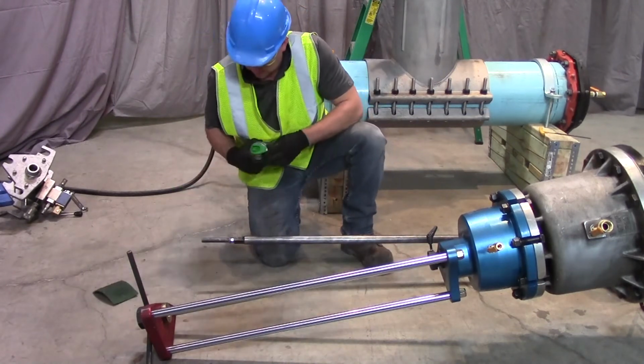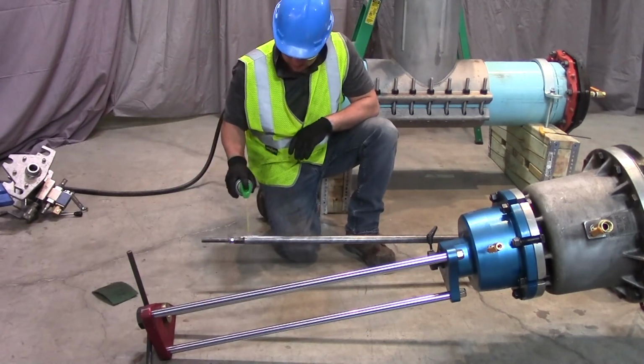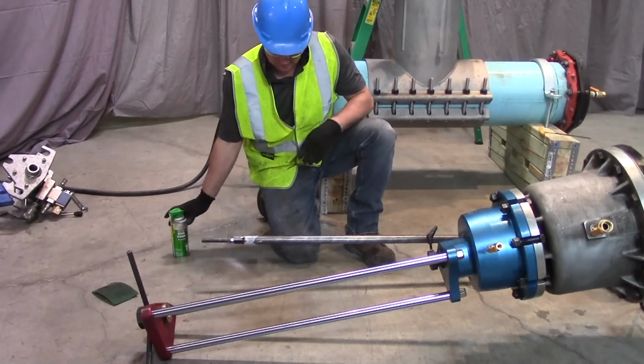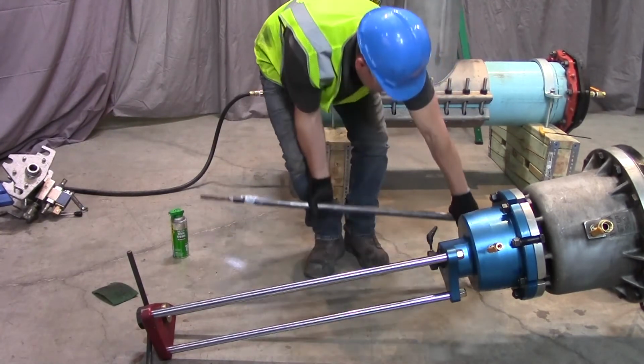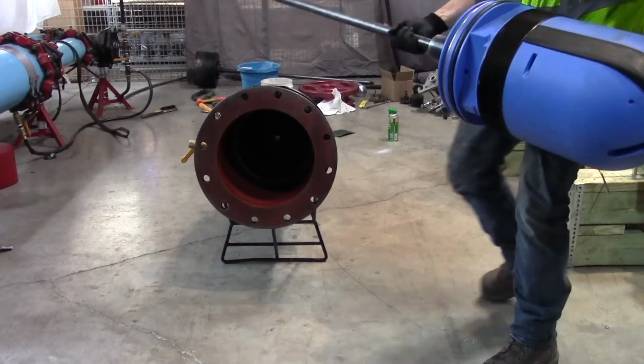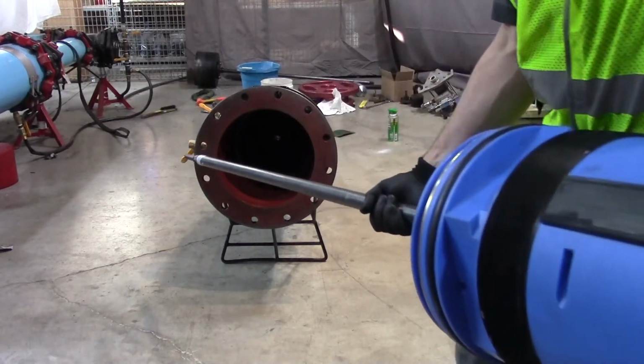Steel wool can be used to clean and smooth the surface. Lubricate the end of the insertion tool with a dab of the food-grade lubricant to help it slide freely through the packing nut assembly. Ensure the packing nut assembly clamp lever is loose.